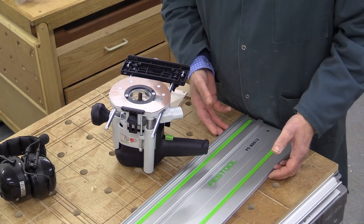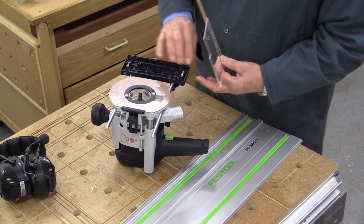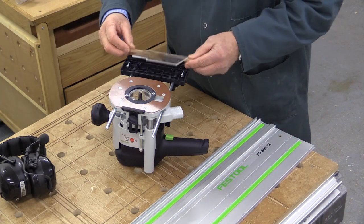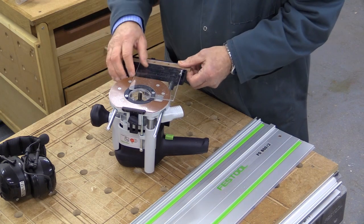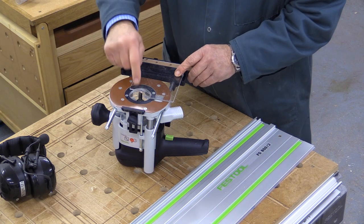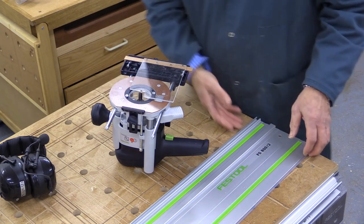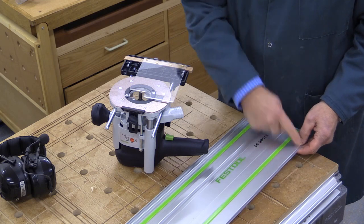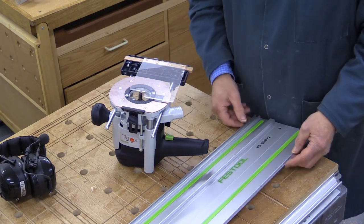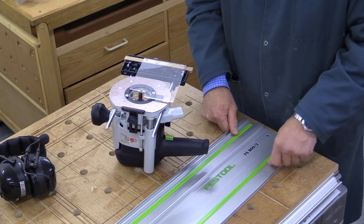When I'm using a router on a guide rail I don't want the cutter to interfere with the splinter guard on the guide rail. So I've made up a little template and turned everything upside down. This is where the ridge of the guide rail will fit, and I've got a piece of wood which is the right thickness to go into that slot, with a piece of perspex on there. This edge of the perspex represents the limit to how close I want that cutter to get to the guide rail — I can have my cutter touching that but no more. That distance is exactly 140 millimeters, and on this brand new guide rail the distance from the back edge to there is 139, giving me one millimeter of clearance.